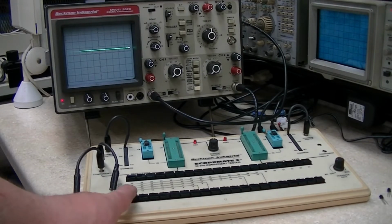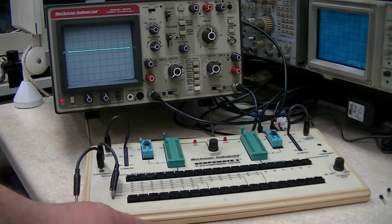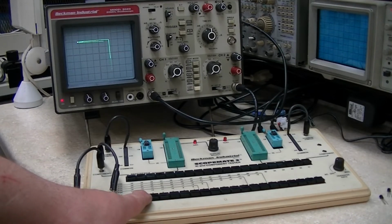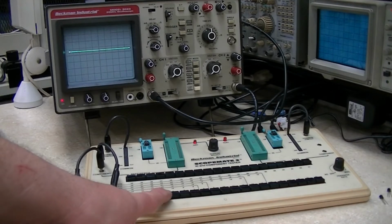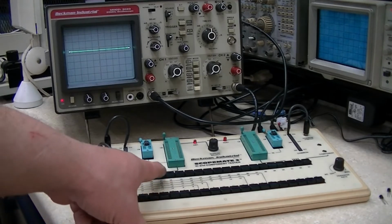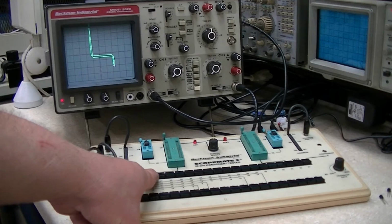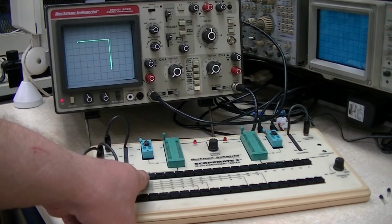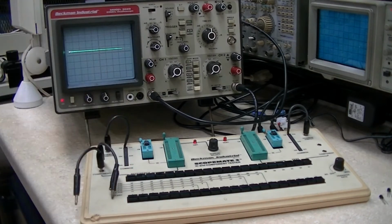They're both the same manufacturer, so hit pin 1, of course, that's going to be dead short because that's what you're referencing from. Pin 1 is the ground. Okay, pin 2, you can see they're about as identical as you can get. Pin 3, same thing. Pin 4, and go up here. Pin 5, pin 6, pin 7, and pin 8. Now next, I'm going to put an NE555 in the test side that was manufactured by Texas Instruments.